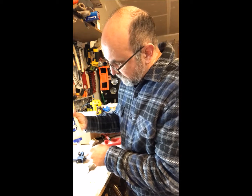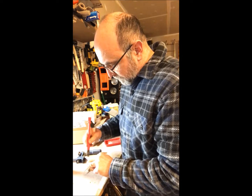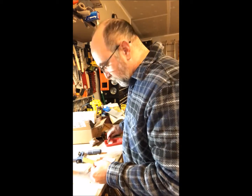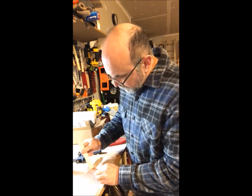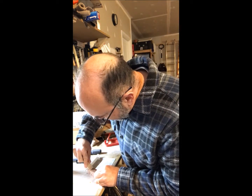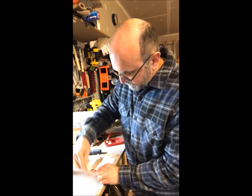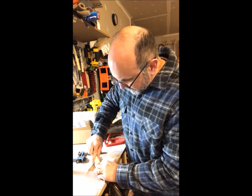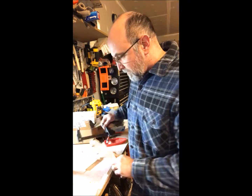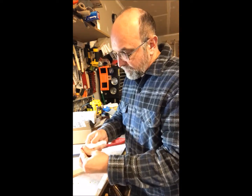and make sure that it's glued up on both sides. And then just slide it into that kerf. It can be helpful to try to make sure that one edge is nice and flat against the board so that you don't have to cut excess off of both edges. Once you've got that slid in there, good and tight, put away your glue syringe, and the glue will keep in this for a long time with that lid on there too, by the way.